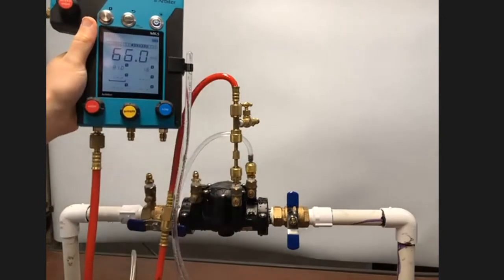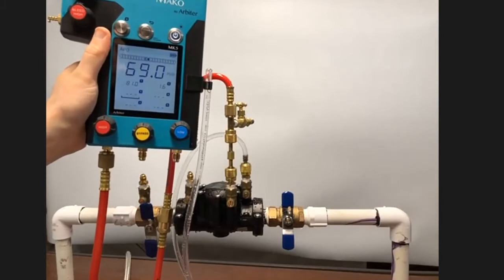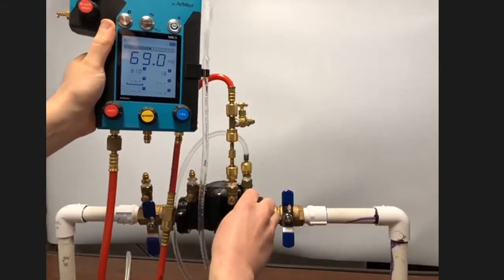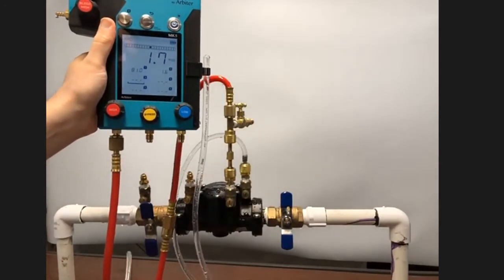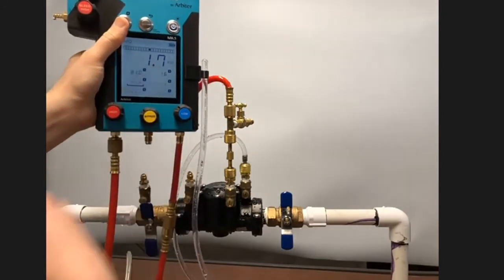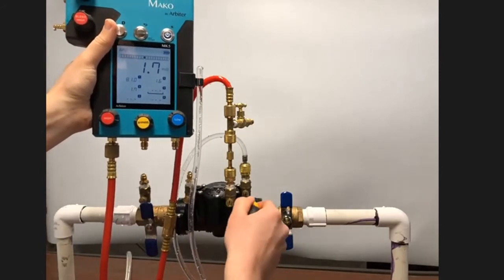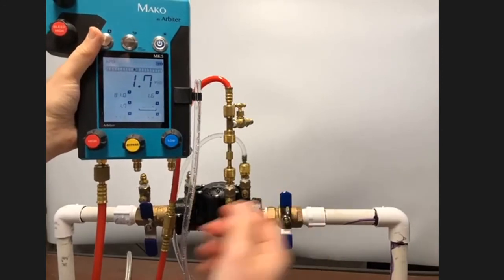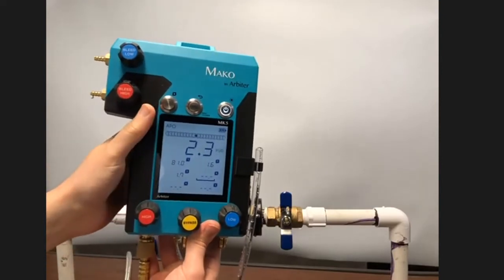And so I'm already at the proper elevation. All I need to do now is close shutoff valve number 1. And in order to get the differential across check valve 2, all I have to do is open test cock number 4, wait for the water to stop flowing or become no more than a drip on my sight hose and the reading on the gauge to be stable. I'll press the capture button. And after that, I can close test cock number 4, test cock number 3, remove all of my test equipment, and reestablish the assembly in the state it was in when I got there.